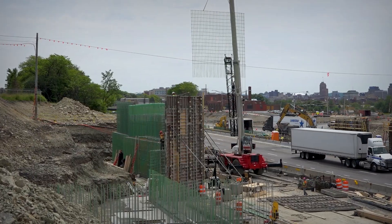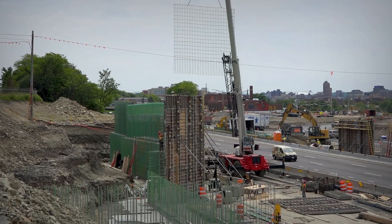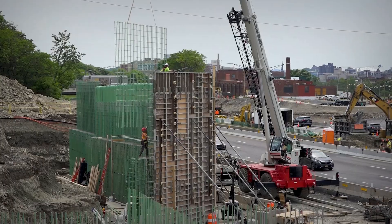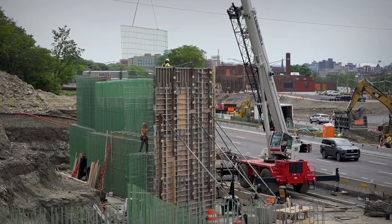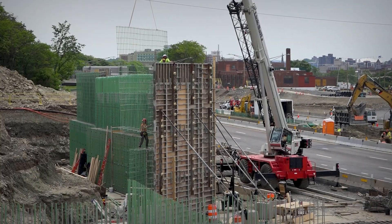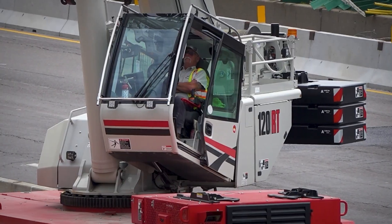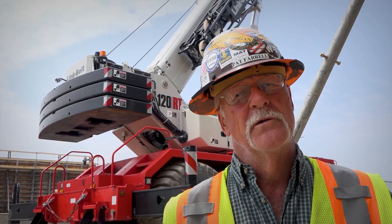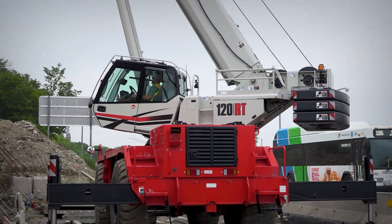My best chart is the 111.2 boom length. I'm picking gang forms that'll run up to 8,000 pounds — they may be 30 feet high and probably 30 feet wide. You can run pretty much flat boom sometimes with this machine. This thing's got a good chart that I can set up in one spot and reach a lot of what I need to do.